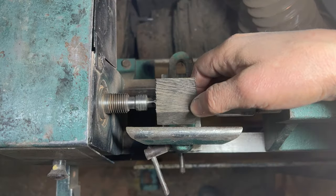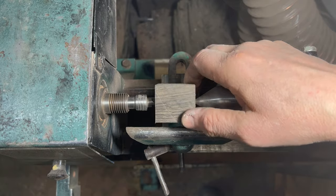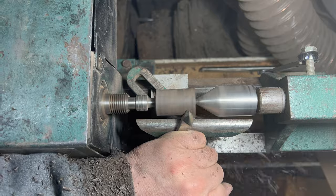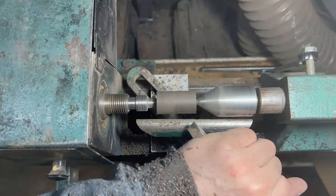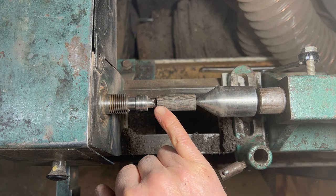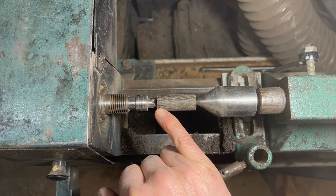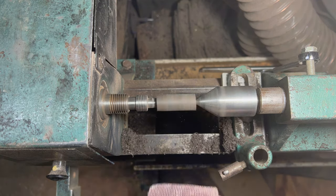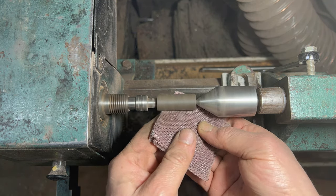So just a 16mm plug needed to go in my little hole. Told you I wasn't going to use that full length of bog oak, just a tiny little square. Two of them, actually, technically, but just going to show you one. That's 16 point something with a tiny little taper down this side just to fit in the hole and smack it in there with a hammer. Going to rough it quickly down with some 80 grit, and it's going in me hole.